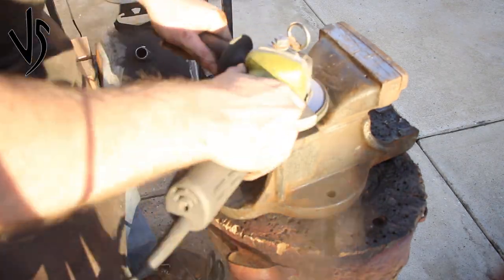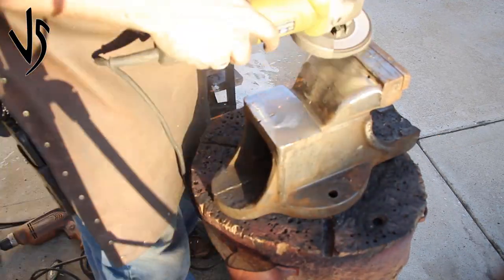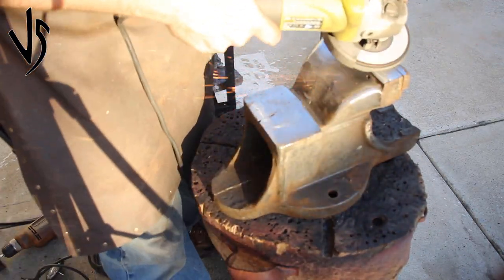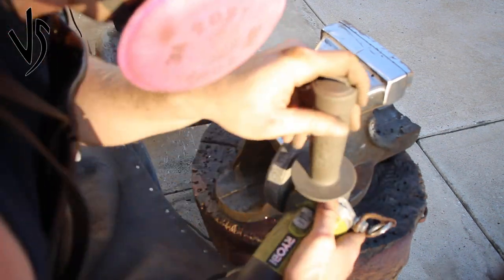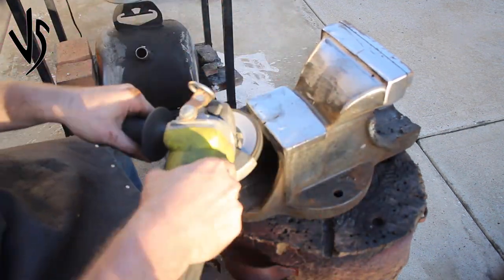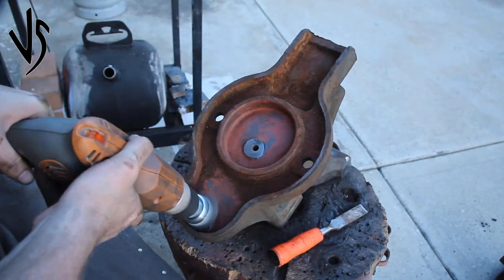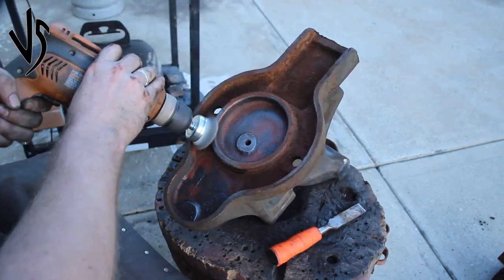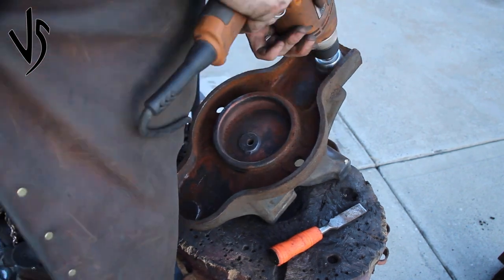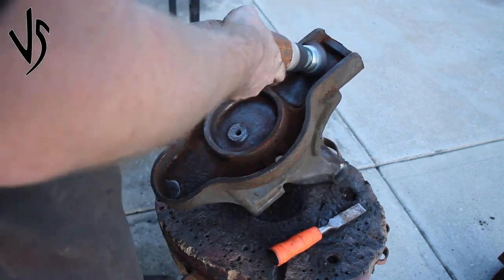As you can see, I'm revealing some cracks in that small dead plate right there, which I will weld up. I don't believe it's carbon steel anyway, so I'm just going to make that look nice and make a good dead plate again. Right now we're just trying to get down to the bare bones, get all the rust out, get all that old grease caked in with dirt. The little wire wheels on the drill make life so much easier. I've since gotten a die grinder, which will be much easier to maneuver in these spots, but if you don't have a die grinder the drill works just fine.